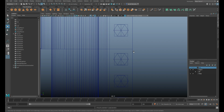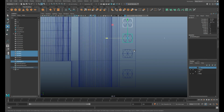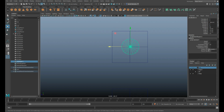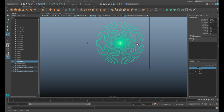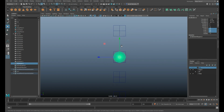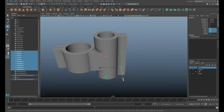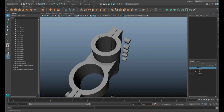Now I'm going to grab a cylinder and match it to that. So I'm going to grab the cylinder and all of my templates here, and I'm going to just isolate those because that's all I need for now. Rotate it 90 degrees, and I want to work with a 100 to make sure it's nice and smooth for the screw cap to fit through. And we're just going to match the size here. All right, that looks good to me. I can make it just 50 even. There you have it. And now I'm just going to duplicate them and bring them up to all those templates. Just grab all these, bring them through. Very nice. So I don't need these templates anymore, so I'm going to go ahead and delete them. And again, we wanted to make it sit 4 millimeters in.